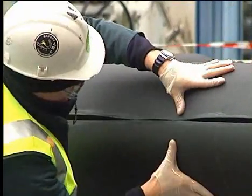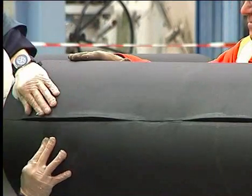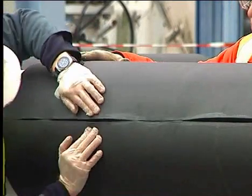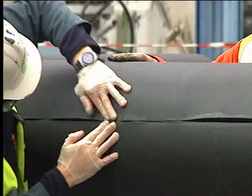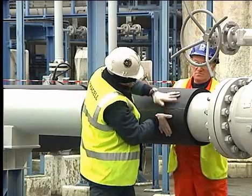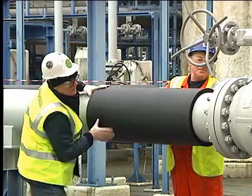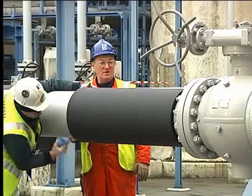Apply adhesive to fixing seam at 200 mm intervals on both edges and fix, after allowing the joint to touch dry. Move the seam to the desired position and avoid placing it upwards. Stagger all seams where applicable.